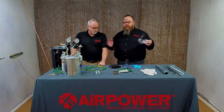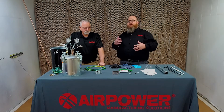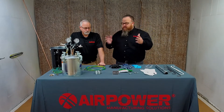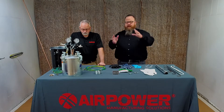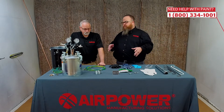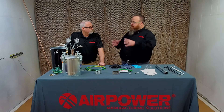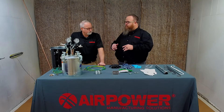Let's talk about this in a grander spectrum. When we talk about a finishing booth or a finishing operation, what in a liquid or a powder booth needs to be grounded? It's pretty obvious — everybody talks about grounding the part. So we're looking at part connection all the way back, and we know that's got to be grounded. We know that typically the gun has to be grounded, the controller has to be grounded. Let's talk about those other things.